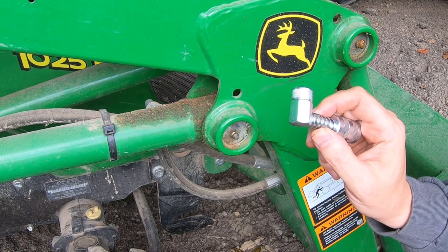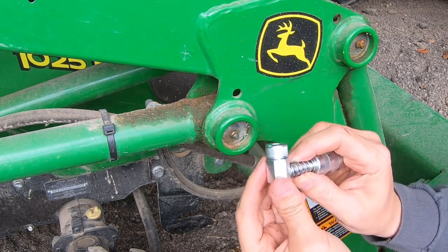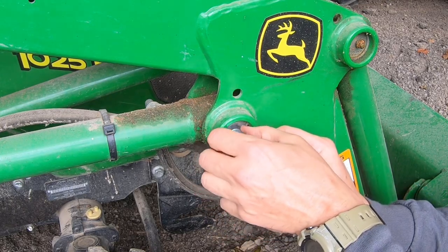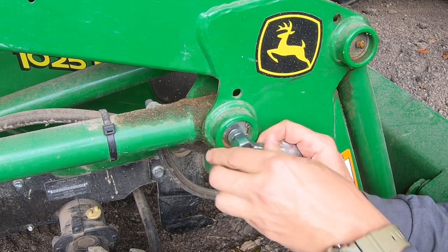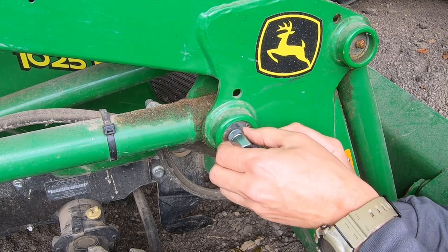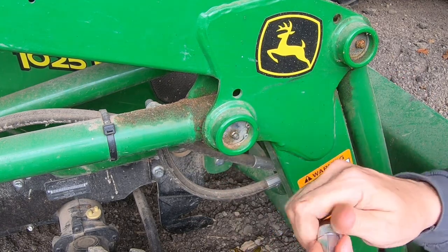On the 90-degree, that's the one I've seen a lot of negative reviews about. Basically, if you loosen that knurled fitting up about a half turn, it'll slide right on. Then just tighten it up and it will hold on and grease that fitting. When you're done, loosen it back up half a turn or so and it pops right off.